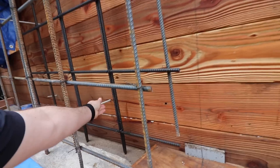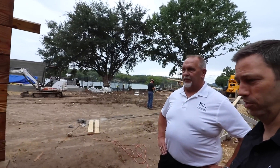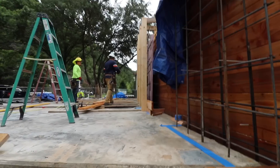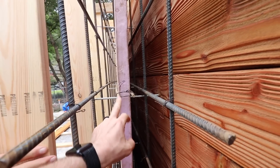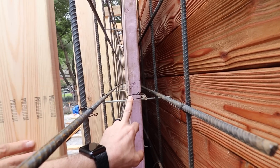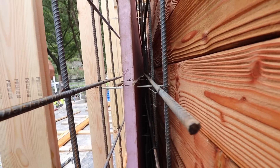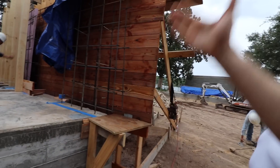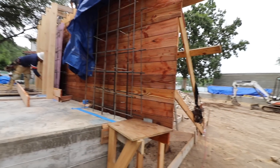And here are those fiberglass form ties that you've seen the guys at Booth use before — they basically disappear once they pour the wall. Now we have a foam core in this wall to give us a thermal break, if you will. So this wall right here is going to be an outside wall in the building. Is this a guest house or something on the property? Yes. You've got an R10 in there in between. So in effect, you're going to have an inside wall, an outside wall, and a big sheet of insulation between them.